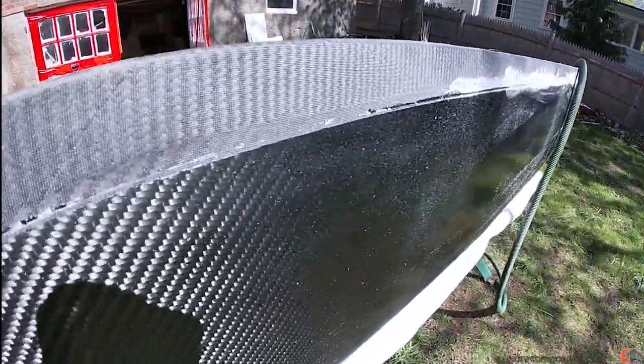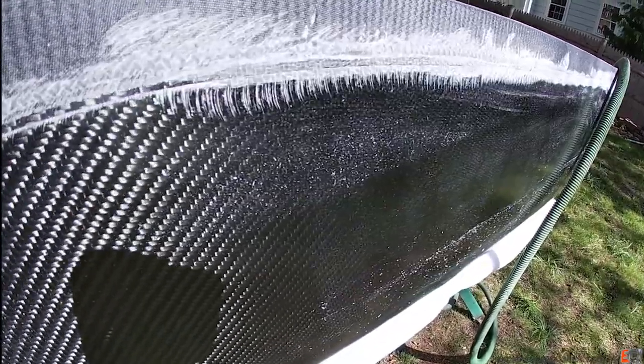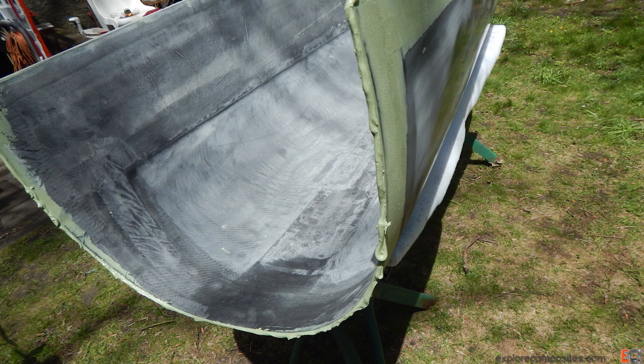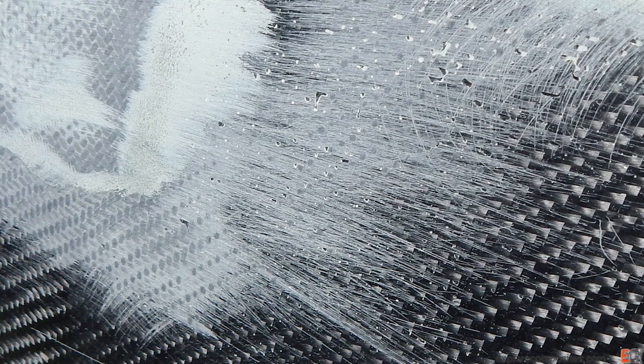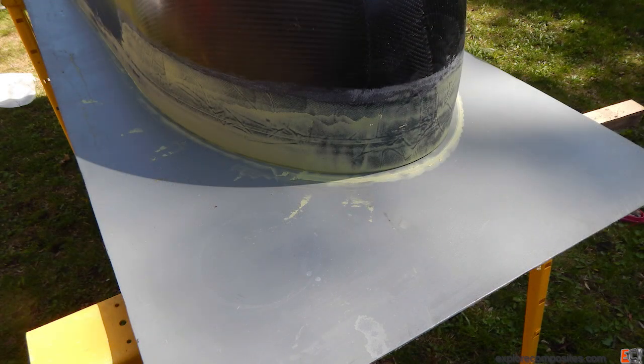The perimeter — sanded it, feathered it in, and it all looked really nice. Then I took some epoxy filler and did a real heavy, quick fill around the edges. I find it's easier to put more on and take a little more time sanding it off than to risk having to make multiple applications with multiple drying times. The first bit was done with epoxy filler, and from then on out I used a vinyl ester. Here I am potting it to a release-coated tabletop. These are some pinholes that were in some of the areas behind the foam core.